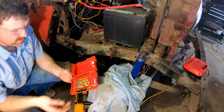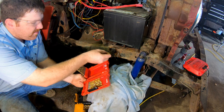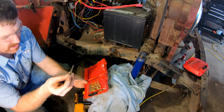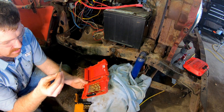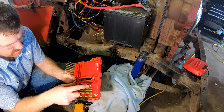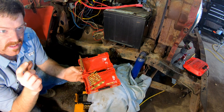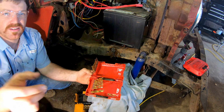I'm going to stop here and check what size drill the easy out calls for. The easy out I'm going to use is a bit heftier — it's a 3/8 bolt — and it says to use a 15/64 drill bit. I'm right here on the drill bit set, so I'm going to work up to the 15/64 and then get the easy out in there.